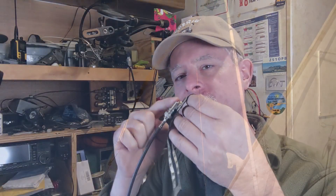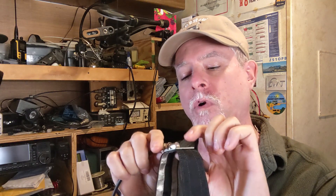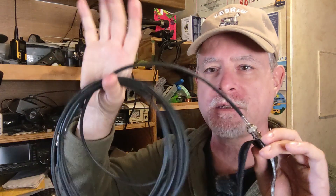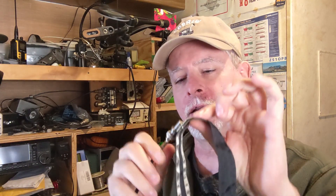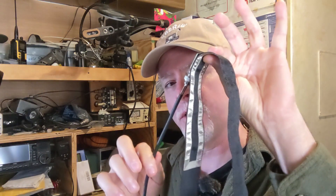So I think this is a weak point. Now Ben did the best he could with the materials he's got — this PC board is pretty strong and it's glued really well to the cloth. But this is a through-hole PC-mount BNC connector soldered into this PC board. A BNC connector itself is not the strongest of connectors. So if you've got 20 feet or so of coax, that's some weight hanging off of this thing. With it flapping around in the breeze constantly over time, the solder connections might crack from the motion, the fabric might begin to tear, or the glue might start to pull away.